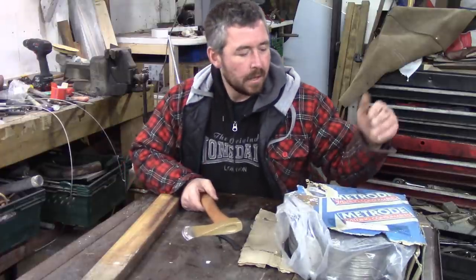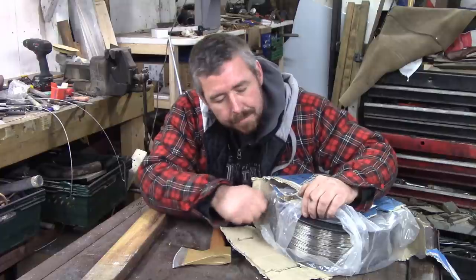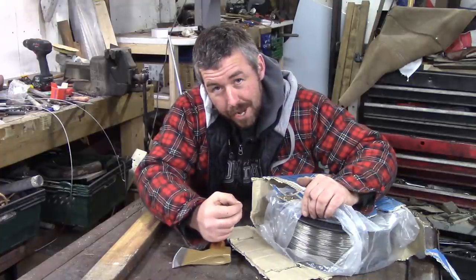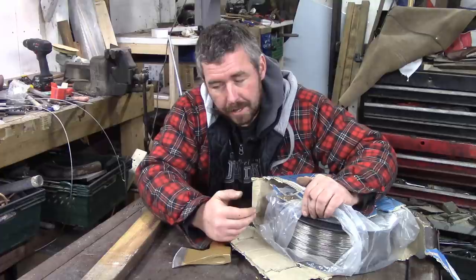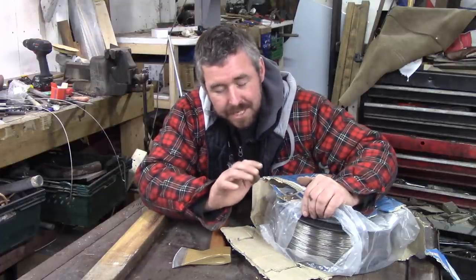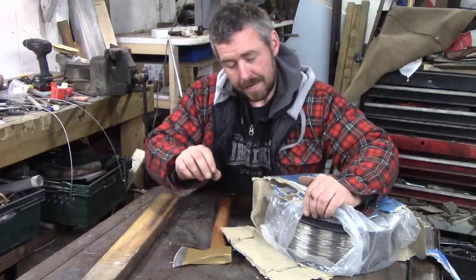I've got some Metrode Hardcore 950, 1.6 mm hard facing wire. You stick this in a welder, and the weld produced is a steel chrome carbide alloy. It's intended for digger buckets, like earth mover buckets, things like that. It has phenomenal abrasion resistance. It's completely non-machinable, it's so hard. On the Rockwell scale it's anywhere between 50 and 60 HRC, depending on how many layers of this stuff you put on.